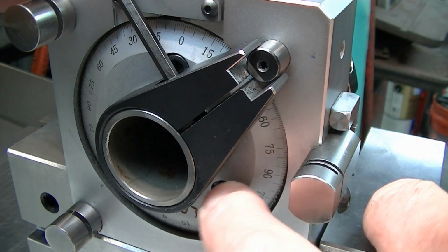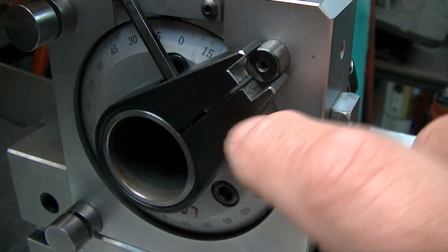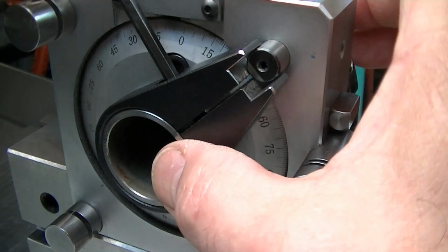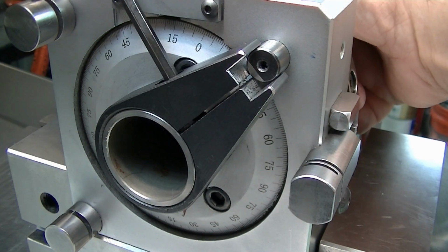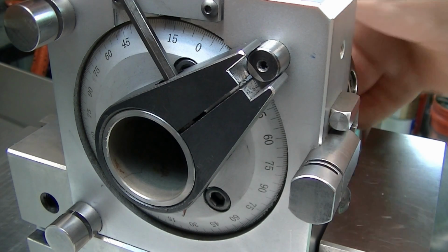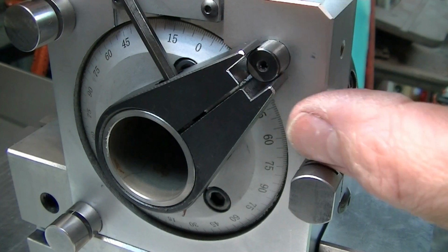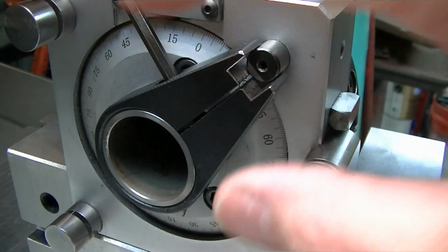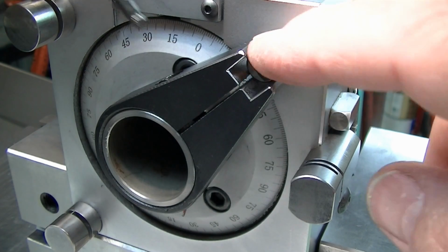I removed the original lock system that was on this punch grinder in redoing the bearing system that's in it. So this crank arm I have converted to be the lock. I have the pin sticking out here enough to grab, and it grabs here. You can see this is free to turn now, but when I tighten this, even just finger tight like that, it grabs the pin and this simultaneously, so there's no play and virtually no influence on pushing the spindle axis around. So just a pretty easy way to get that thing to lock.